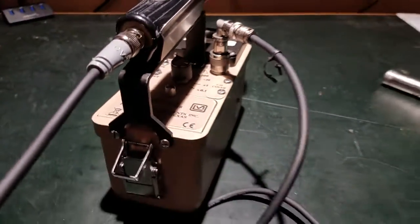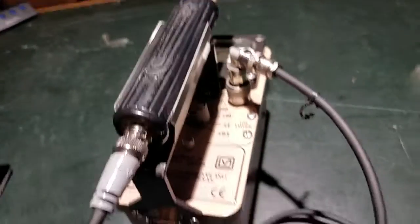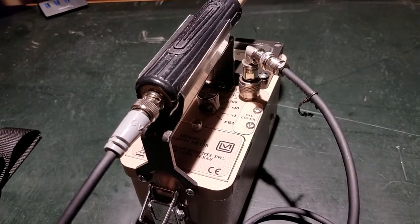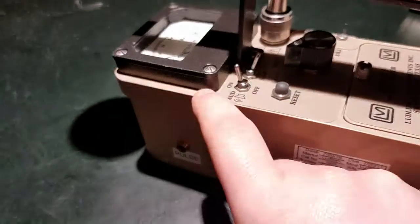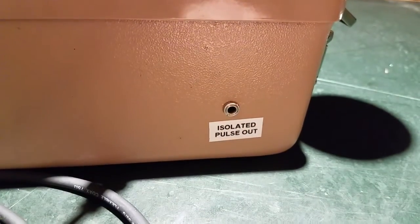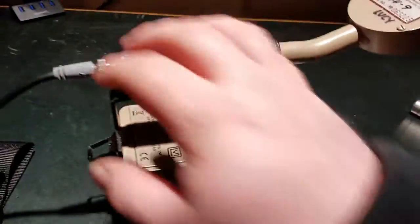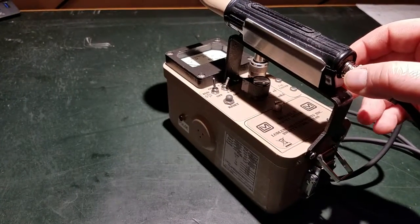I also have a nice flexible cable because my curly cable broke. There's a calibration door. Three modifications have been made to this instrument. The first mod: because I didn't always want the sound on but still wanted to see individual detection events, I added a pulse LED. Related to that, I also added a data out jack so I can hook this up to a computer or other device to count the number of pulses digitally. I can actually use this as a scaler when it's attached to a pulse counter or computer.